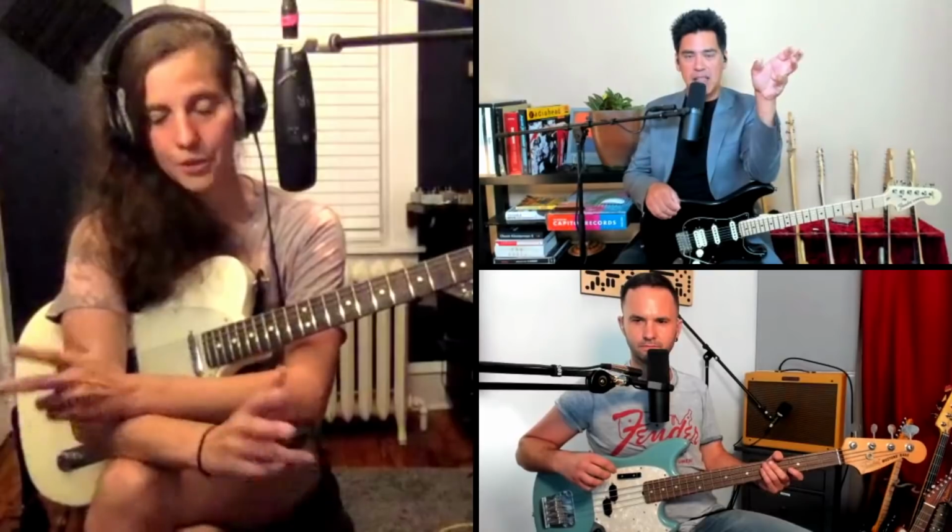Yeah. Also, I'd encourage that when you have more distortion, you might want to roll the bass control back a little bit. I think what happens is, right, Dylan, when we have more distortion, we're actually compressing things. We're actually losing a little information technically. Yeah, and sometimes it would eventually get muddy. You'd end up at just a single tone if you just kept distorting something into entropy. You lose bass and you begin to lose treble eventually too. So you just end up with a completely compressed volume and frequency signal.